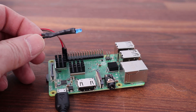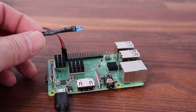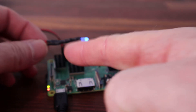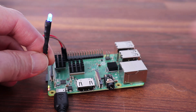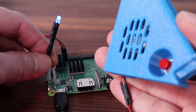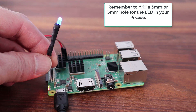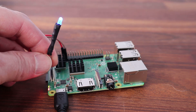Just to sum up: I've got the LED correctly plugged in and the micro SD card back in. Let's power on — and there we go. You can see it booting up with the light on, which is handy so you know the Pi is on. I also have a red push switch here which puts the Pi into a suspended state — I'll be covering that in another video. If you're interested in seeing that rather than the usual hard power off, which can corrupt a micro SD card, please like and subscribe. Thank you very much.